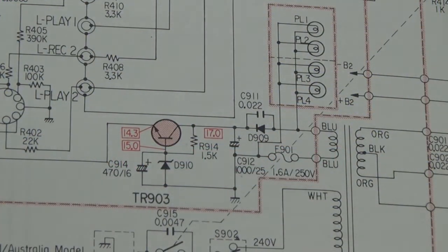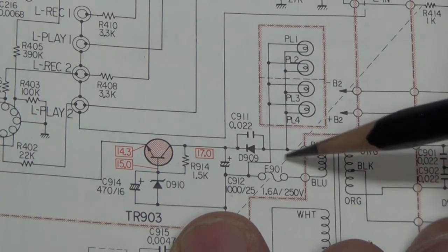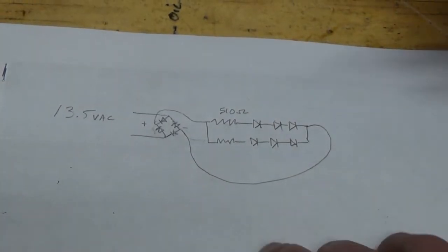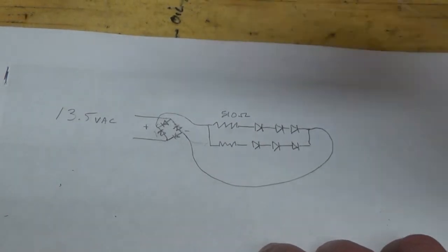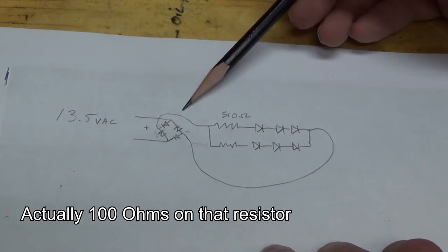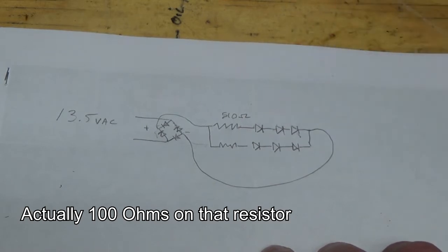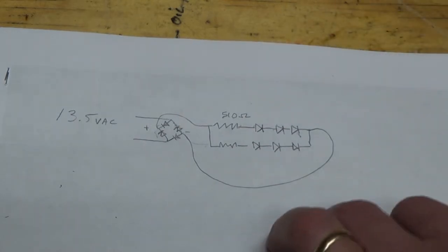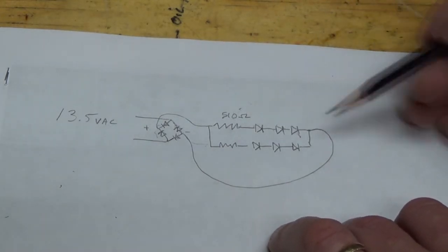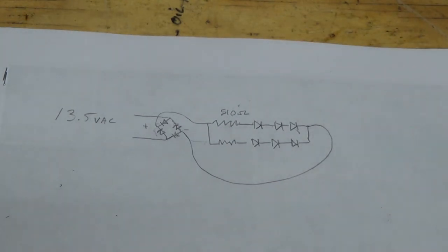This is the way the bulbs are currently wired. They come right off the transformer, AC, pass a fuse, and then they're wired in parallel. So here's a circuit I'm going to use. I'm using a bridge rectifier because I don't like the blinking of LEDs if you don't use one, and then I'm running through a 510 ohm resistor into 3 LEDs. I figured out this resistance from the values of the LEDs, and then I just used an online calculator to figure that out.